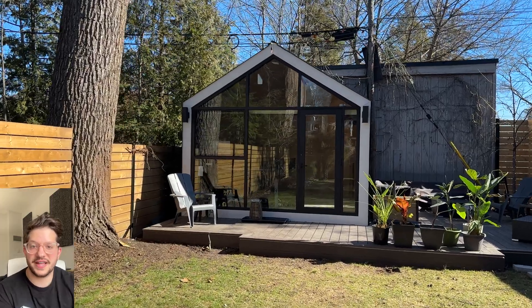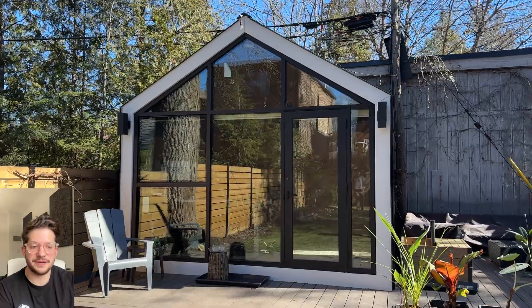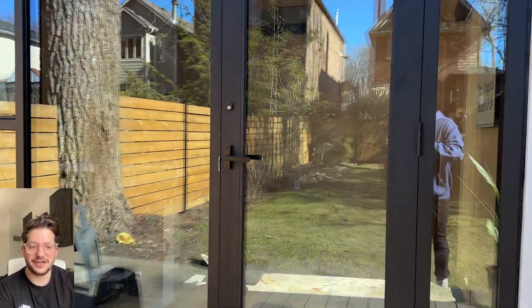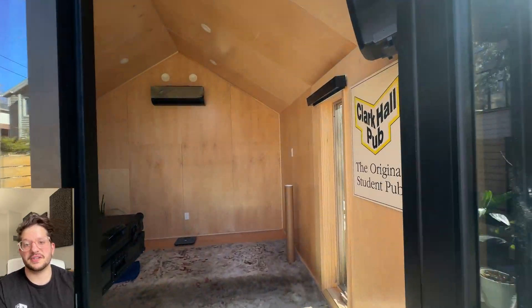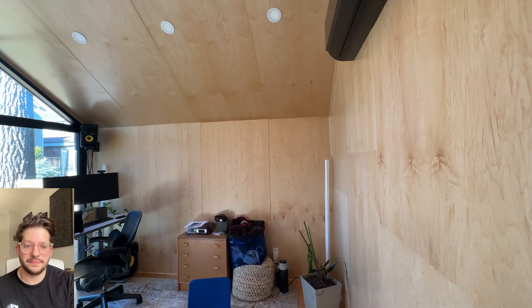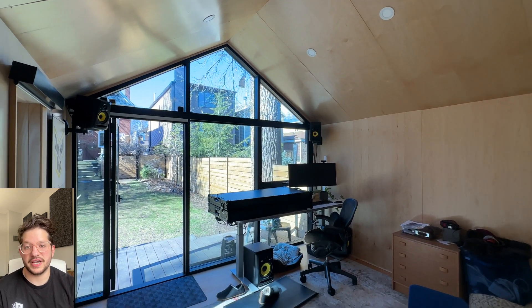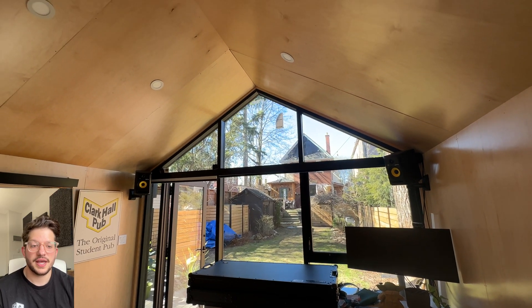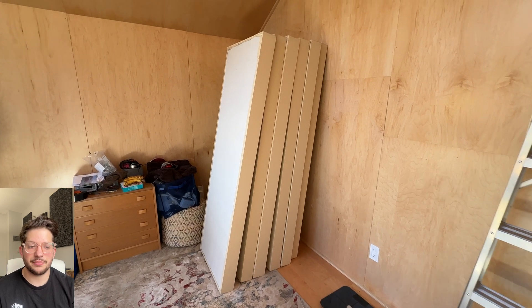Here is the client's studio — a really cool DJ studio detached from the house. Here's a little tour and sneak peek of how it looks before we add the ceiling treatment. We are doing a lot of cool stuff for this build: acoustic panels, custom bass traps, and a very large diffuser for the rear wall — stay tuned for those videos. The client has it all wood-clad on the inside, which helps on the install because we can screw directly into the plywood sheets without drywall anchors. We'll be mounting the panels in between the pot lights, following the angle of the ceiling.